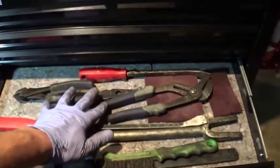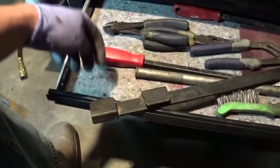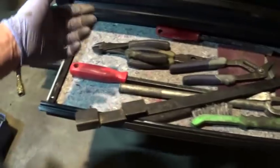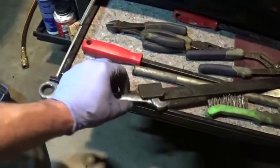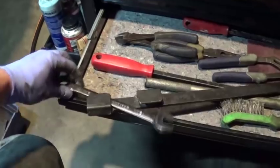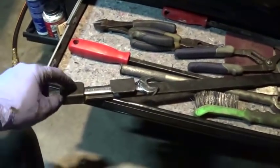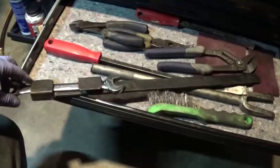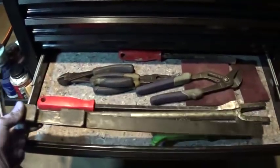This drawer has some pliers and a brake bar. This is something I made a long time ago that really works well — if you have to use a wrench to loosen a bolt and you don't have enough leverage, you can put the wrench into this handle and it gives you a long grip. Sometimes using a second wrench can slip off, but with this tool you just slide the wrench into the handle. I made it from scrap metal with two hooks. I actually have another handle so I can extend it further by sliding it on, and usually you don't need it, but I just keep it in the cart. This is one of my favorite tools.